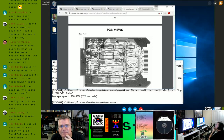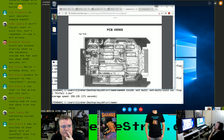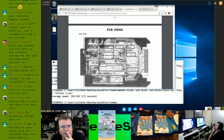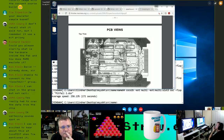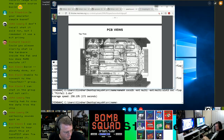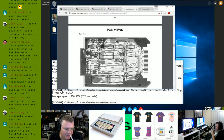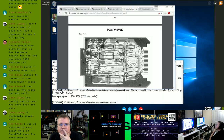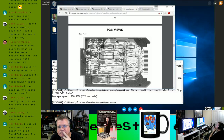Oh wow! I have a question that comes to mind: are the parts still available? Otherwise, should a clone be made of the sound speech pack? Well, the microcontroller was never made available. It was a very proprietary part, only sold to Radio Shack to create this device. But the programmable sound generator, the RAM, and the speech narrator, I believe those are all new old stock. I don't know if any of those are still available.